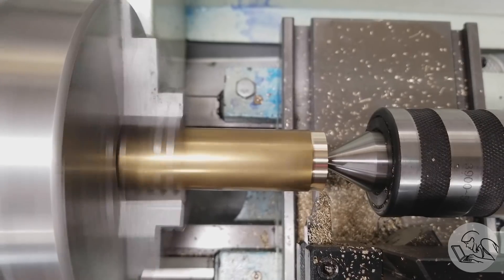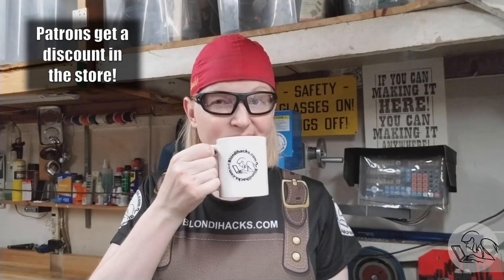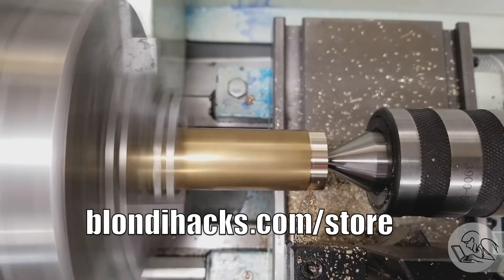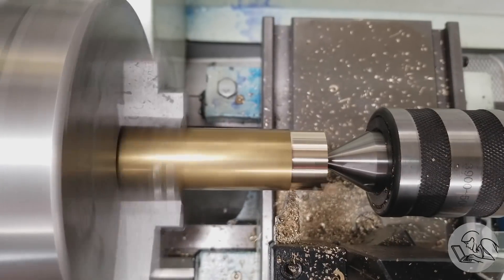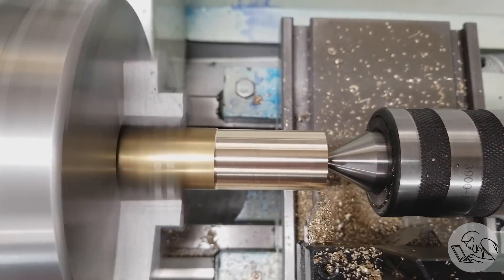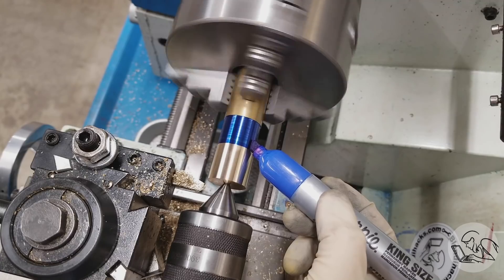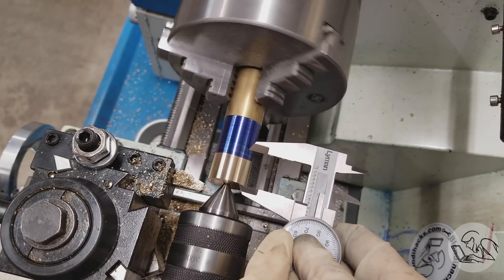Now watch this chip action — it's going to be really amazing. Make sure you're paying attention; don't look away as this tool bit touches the work. Oh, marketing is terrible, isn't it? It's not actually that exciting — pretty typical turning operation — but you can see as the bit moves across, we're actually turning that bend right out of the work and we're left with a very true piece of stock. The cost we paid is having to take a fairly deep cut, so I lost some diameter. The final knob won't be quite as large as I wanted, but that's okay — it'll still work.